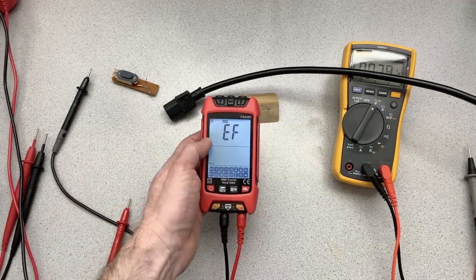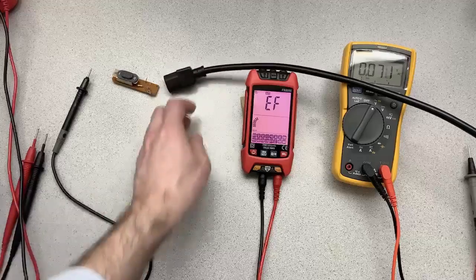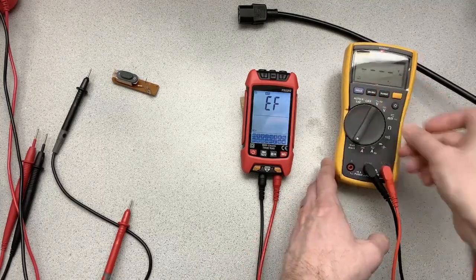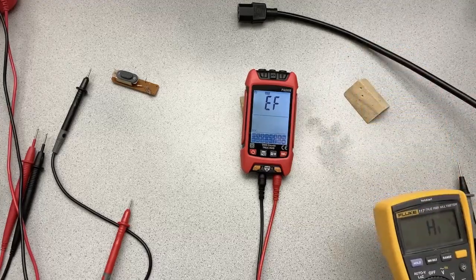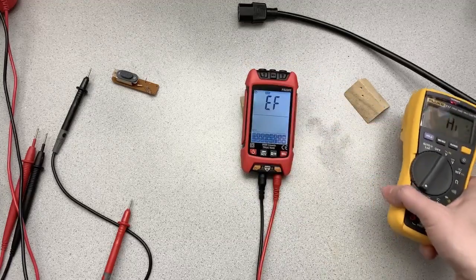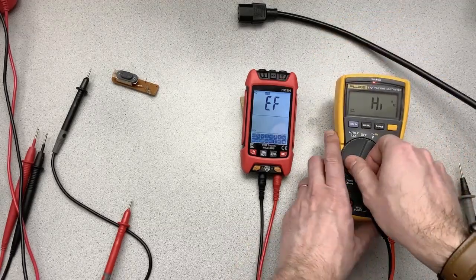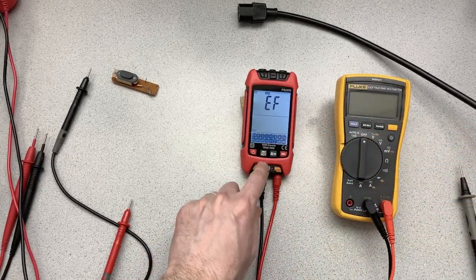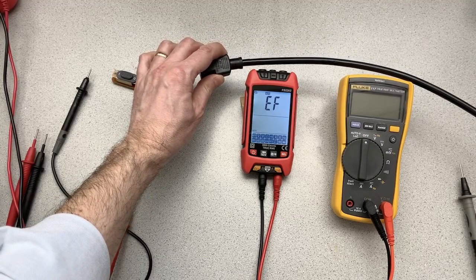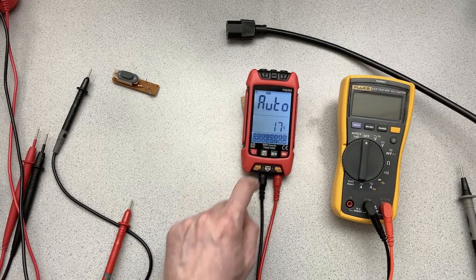All right. So we've looked at continuity. We've looked at resistance. Oh, see, that's a live wire. Okay, and the Fluke also has that capability, although I don't tend to use it. You can see it's much more sensitive. See, at that same distance, the Fluke is showing me the field. So, okay, we'll just turn that off. So although the non-contact voltage works, it's not really super sensitive. So you've got to get right up to the wire to sense it. Oops, flashlight. Okay, back to auto.